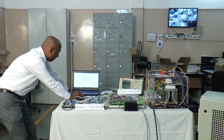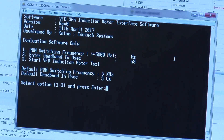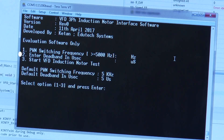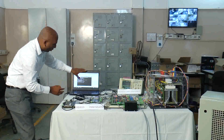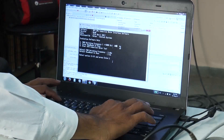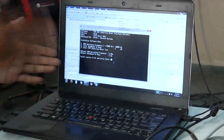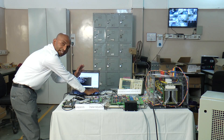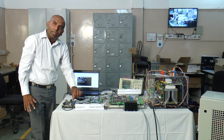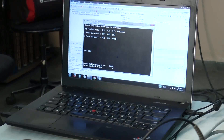In this program I am going to run the open loop program and execute it. At this point we can set the switching frequency from 2 kHz to 20 kHz, as well as apply the dead band as per the desired values. For this open loop, the switching frequency is 10 kHz and the dead band is 4 microseconds. Now let us run the motor program. Once I click execute, the motor will start rotating depending on the ADC voltage from this potentiometer.